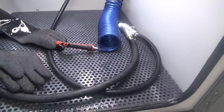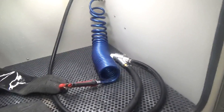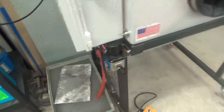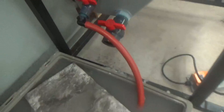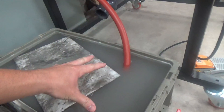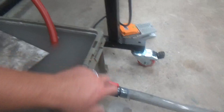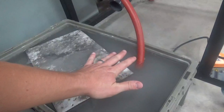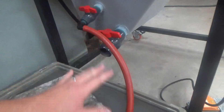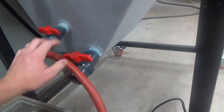Again, the first step is rinse all the machine out, rinse the drip pan. Then come over to the side and start draining the water off the hopper with this valve into this bin. Let it settle, let the abrasive settle. Then crack open this valve — we're doing that now — and drain this water down. Once it's drained, open this valve again and repeat these steps until we get this machine cleaned out.